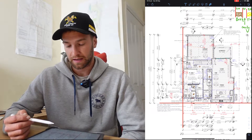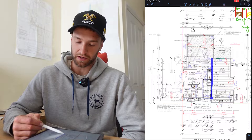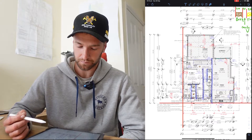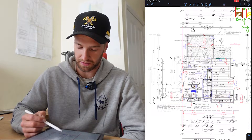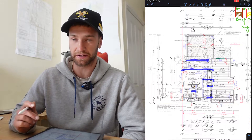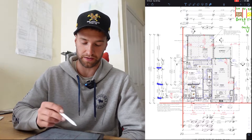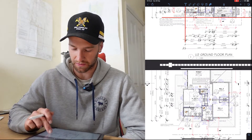When we flick out, I always choose to start with the longest walls first and work in a direction — pick up all the walls going one direction, then come back through and pick up all the others in the other direction. It's just easier because then you're only reading one scale at a time rather than trying to flick out rooms.